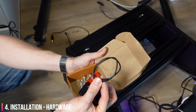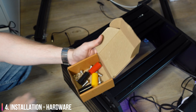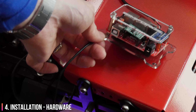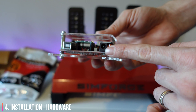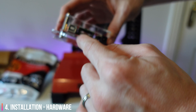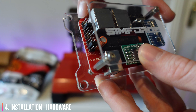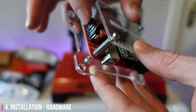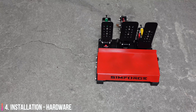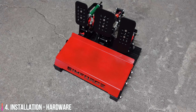You may need to ground the circuit board. When I initially received the pedals, I was seeing a lot of fluctuation in pedal inputs from the brake, which is extra sensitive due to its 24-bit sensor. With lots of back and forth with Simforge, they changed their design and the latest circuit board works a treat with no interference whatsoever. If you do see pedal input fluctuations, I'd highly recommend getting a dedicated power supply. It's a shame that power supplies aren't provided, as it would make the interference a non-issue. The circuit board relies on USB power to function, and if this power supply is interrupted or inconsistent, you can get fluctuations. If you use a mains power supply, you can flick a switch to bypass the USB power — no other pedals I've reviewed offer this functionality.